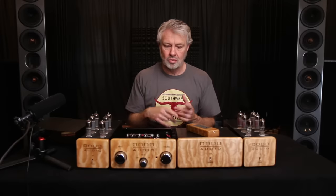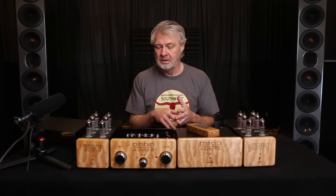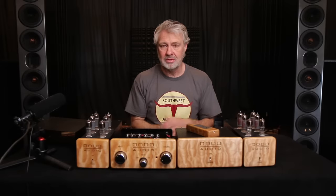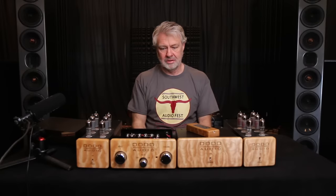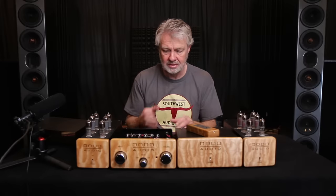We found that the little C-Tech chargers would keep those things topped off. We could just leave the C-Tech charger on its little trickle charger setting — it wouldn't affect the audio signal and it would keep the battery between 13.5 volts and 12 volts all the time. So we never really discharged the battery, and the batteries would last eight years or more. A 100 amp-hour battery is a big battery — 50-some pounds, maybe 60 pounds, heavy. They're around $225 — cheaper than a power cord. That plus the C-Tech charger and you're good for a long time. The battery issue is essentially a non-issue, and it does offer a lot of improvements for getting stuff off the grid.